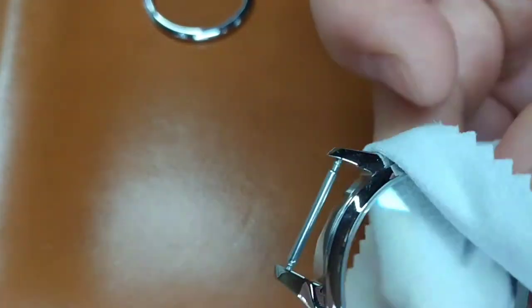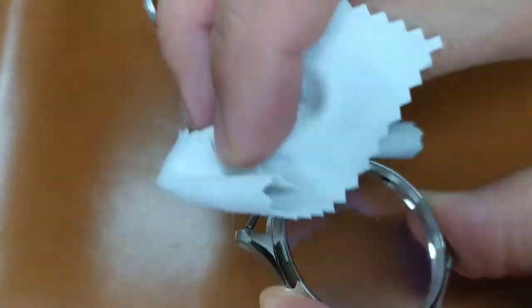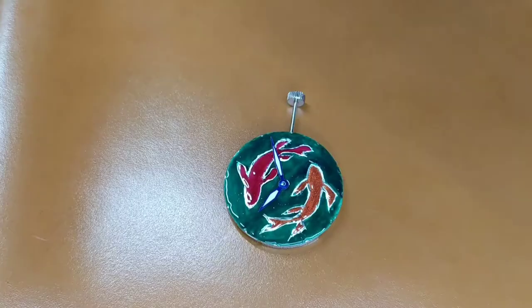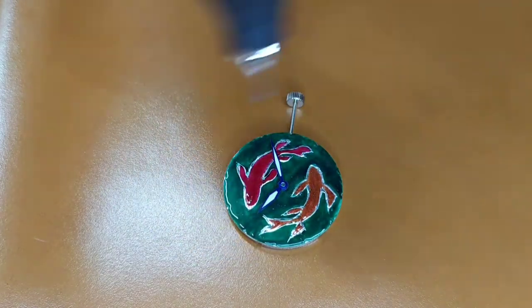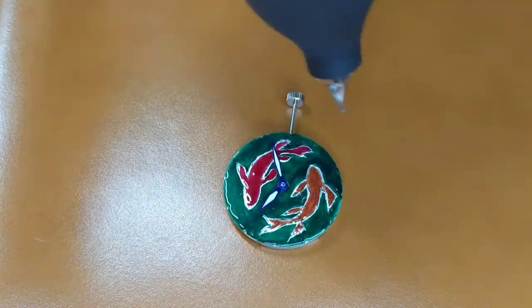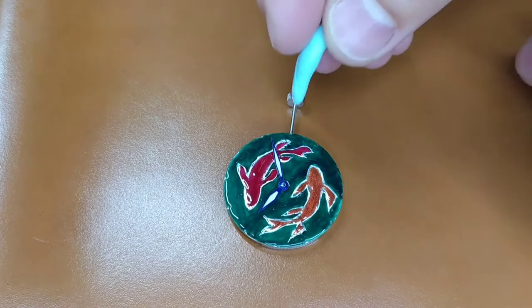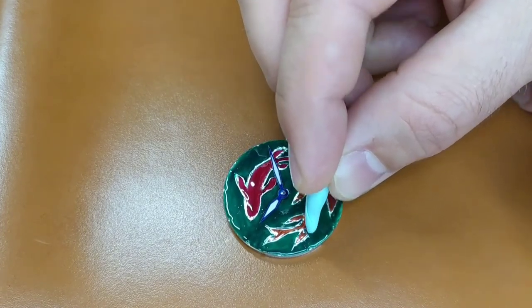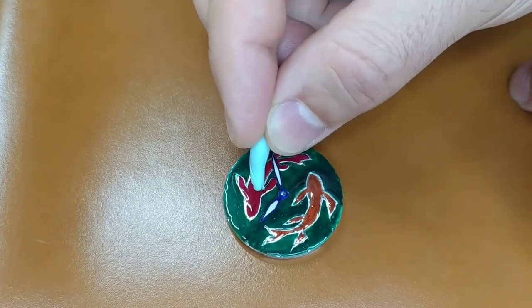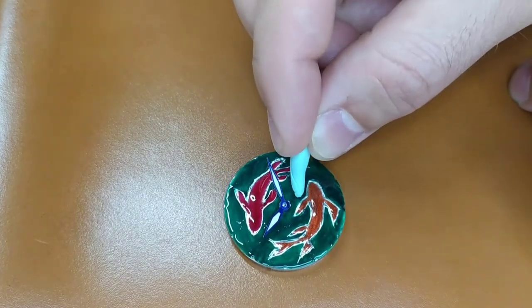At this point, I clean the watch case of any dust using the air blower and a clean dust-removing cloth. Also, we need to remove the dust from the watch dial as well. You can use the air blower and a Rodico by gently pressing the Rodico at the points where you have spotted specks of dust. If you don't spot any speck of dust, obviously you don't have to use the Rodico at all.